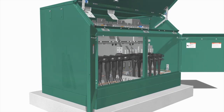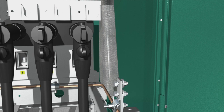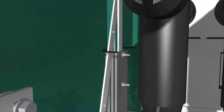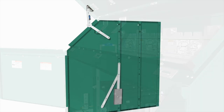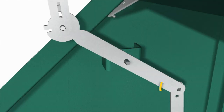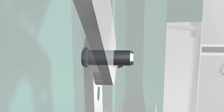With the roof lowered, we can now connect the counterweights. Remove the shipping materials surrounding the counterweight mechanisms at both ends of the enclosure. Cut the plastic cable ties holding the longer lever arms in the down position. At one end of the enclosure, pivot the lower lever arm up and position it to the back of the shorter upper lever arm. Align the holes and press the captive pin through the holes in both lever arms. The pin is self-securing.